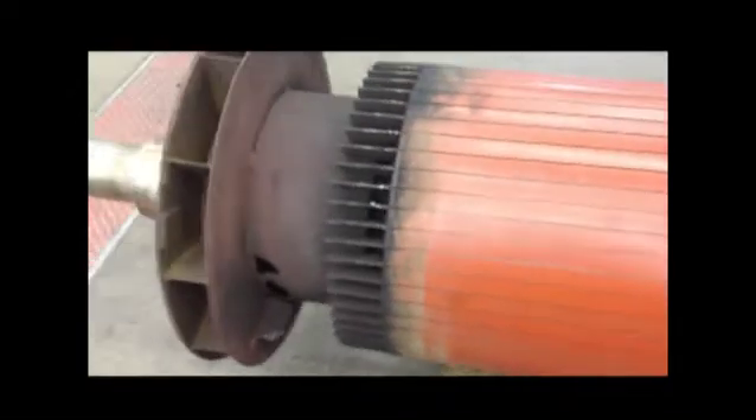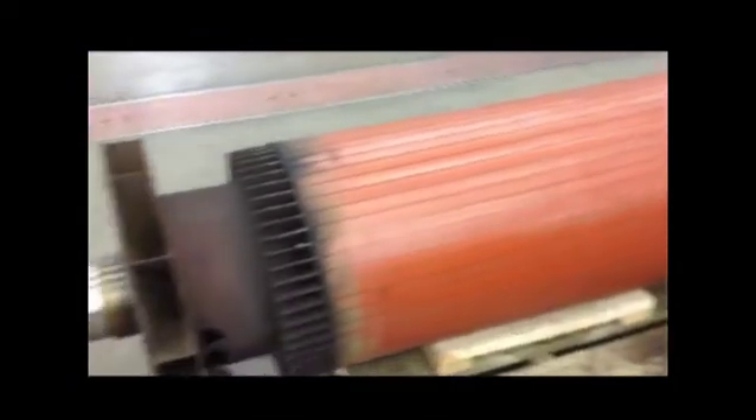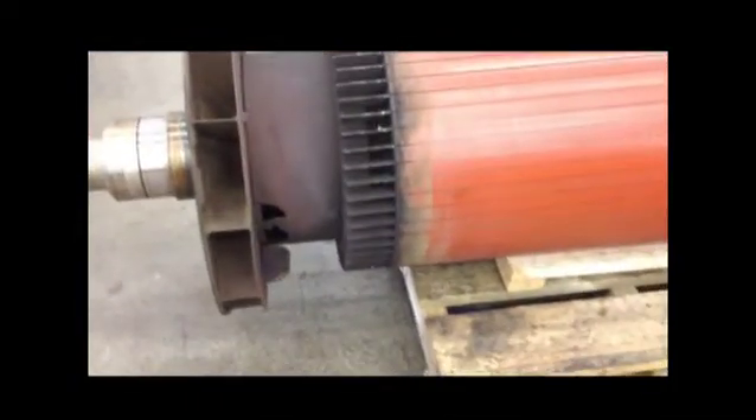This is the rotor from the stator we just looked at, and you can see it's rather long — about six or seven feet in length. What we believe to be the root cause of the winding failure is that sheet metal attached to the fan, the internal fan of the motor, has come loose and flared out and struck the winding. There was magnetic metal within the hole blown in the stator, which we think was part of the fan material.